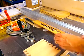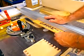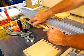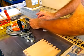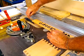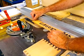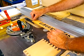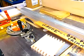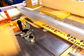My material can go underneath the gauge. I set it against my fence and then I bring it just a little proud of the teeth here. The distance between this edge and the teeth will be how much the pins stick out. I want them just to stick out just a little bit, so I bring it this way and set it on there like that.